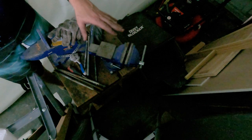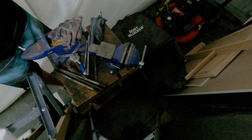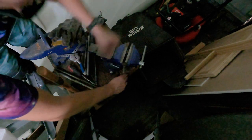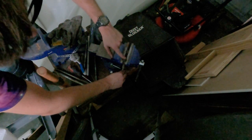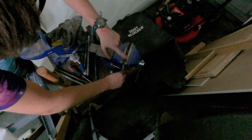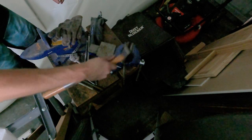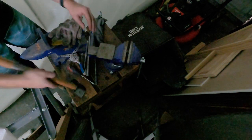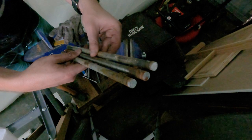I apologize for the poor lighting in advance. The paint booth is still up because I need to finish off this trailer before I can pull the boats out and break the paint booth down. What I'm doing with this vise is opening it up so the center post is free in there, then resting the nut on it, and we're going to hammer down on the nut and drive this post down. There we go — there's one. We'll take these back out and start sanding them down to get them prepped to receive the new nuts.